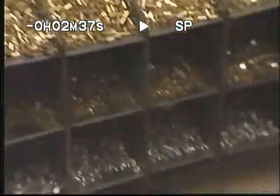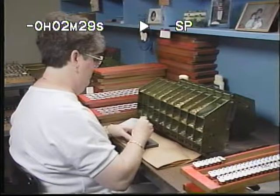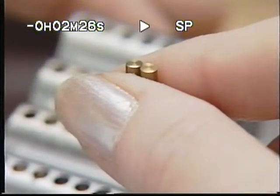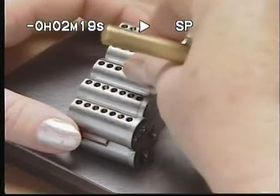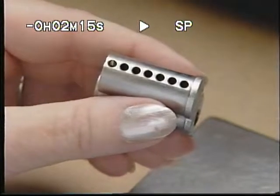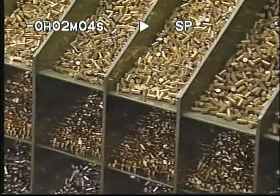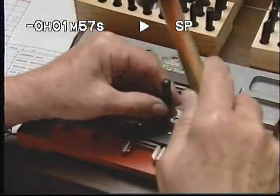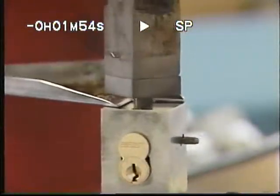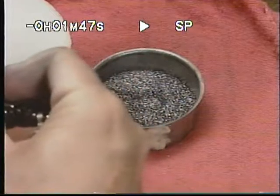The following tips will help to increase your combinating productivity. Do not write out segments to be used in cores; work out the math in your head as you combinate. When two similar segments are in sequence, pick up both segments at once. Combinate four or more cores at one time. Combinate the first barrel on the core and push the segments into the barrel with the ejector pin. Combinate all the remaining barrels before using the ejector pin again. Use bins to hold your pin segments instead of combinating kits. When stamping keys and cores, stamp all with similar markings at one time, then go to the next marking. Combinate all barrels, then spring and cap them. When testing cores, keep a bowl of graphite and simply dip each key into the bowl instead of shooting graphite into the core.